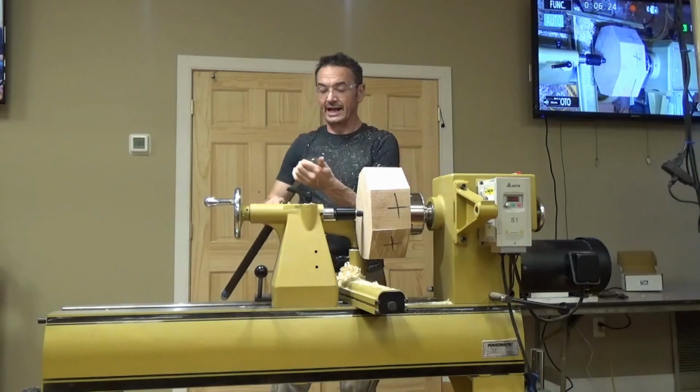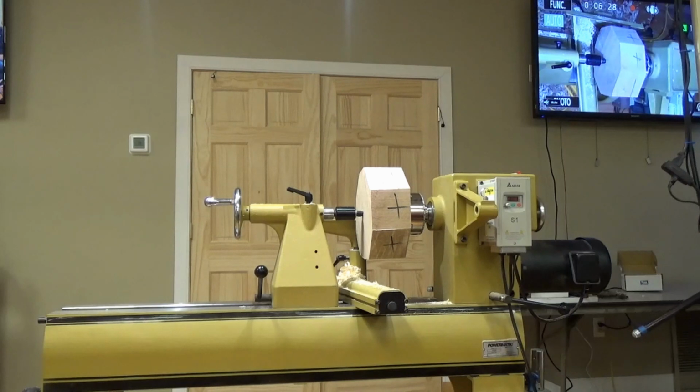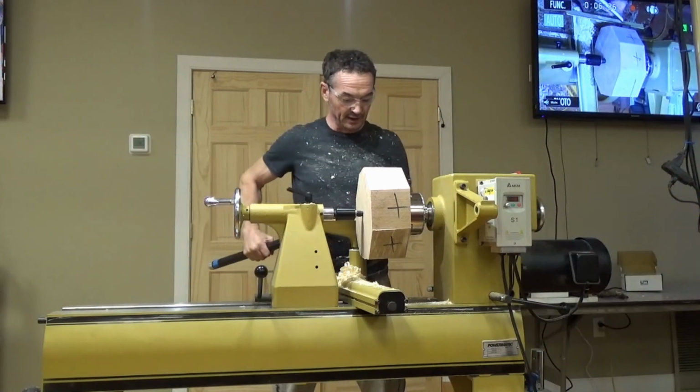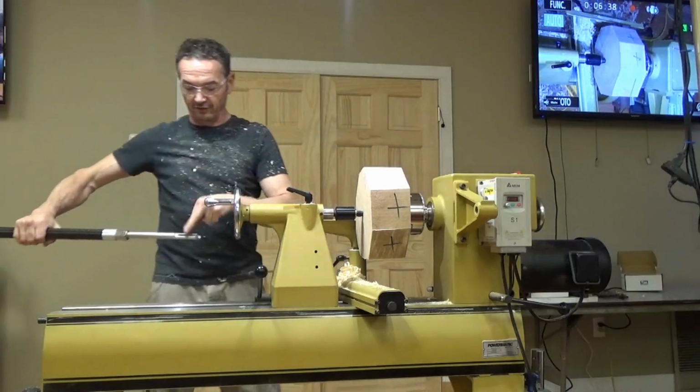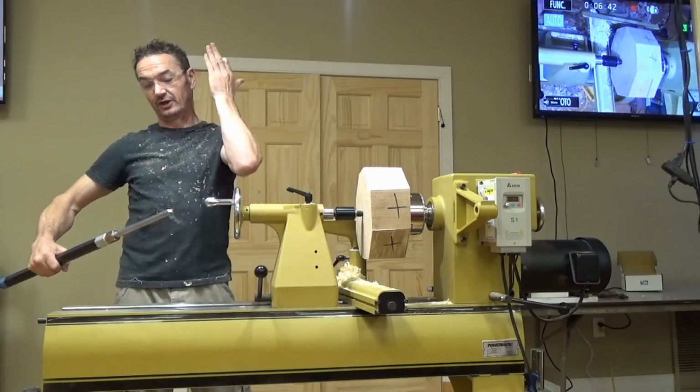Okay, back to that cut down to the round. So, lining that little bevel up. This bevel, I'm lining that parallel to the outside of the bowl. That's where it is. So I'm going to be touching both in this and here, straight across. So I'm looking down on the tool to make sure it's in line, standing with the flute just open enough to throw the chips. I don't want it too open because then it becomes aggressive and the chips are also going to hit me in the face.